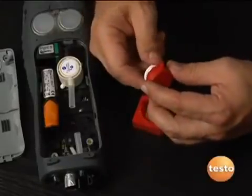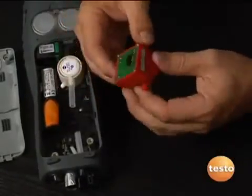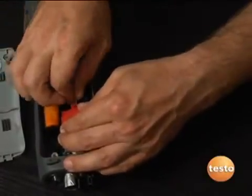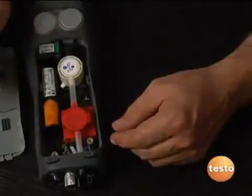This is really easy to put back inside. We'll just line the filter up with the cartridge, snap it back in place — it locks in. We line up the cell with the instrument and pop it right back into place. Typically, the technician can change these cells out in less than five minutes in the field, so this really is going to eliminate your downtime with our instrumentation.